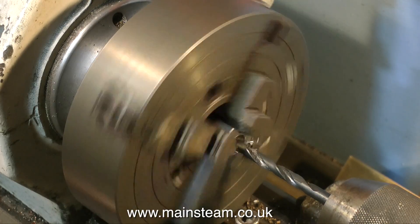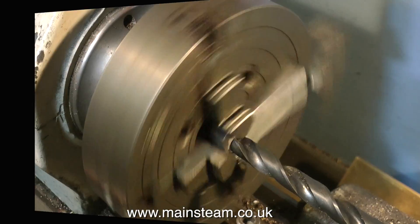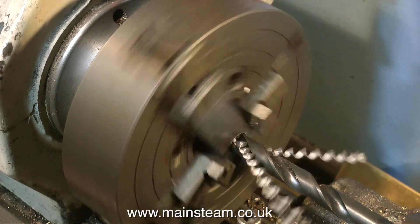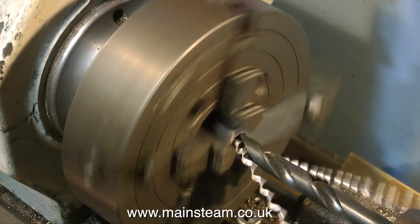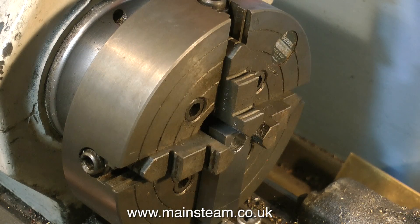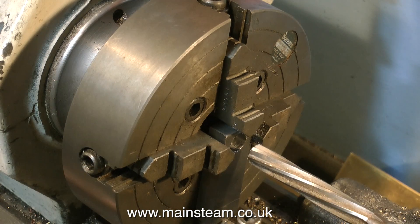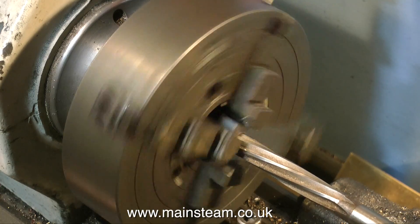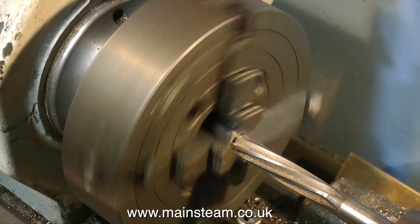You're currently watching this process in operation. The first thing to do is to securely clamp the piece of metal into the four jaw chuck and align it so that when you use the center drill it drills a hole exactly where you need it. After drilling a pilot hole with a quarter inch drill, I would then drill through the work using a drill size one imperial size less than the finish size required.